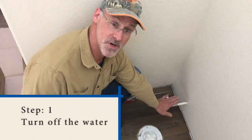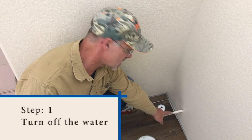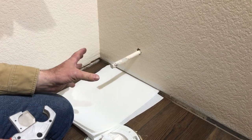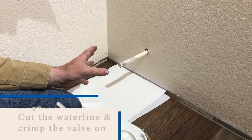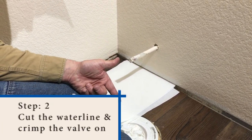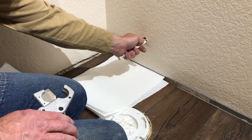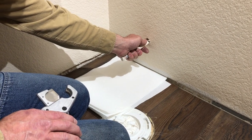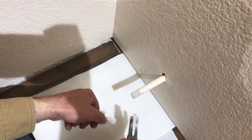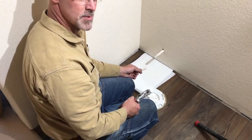The first thing we're going to do is shut the water off to the house so that we can cut this line and put this valve on it. We've turned the water off. I've opened up some other valves to help drain the water down into a sink in the basement so we won't have a whole lot of water pouring out here, but I do expect to get a few drips. I guess the vacuum down into the basement worked.